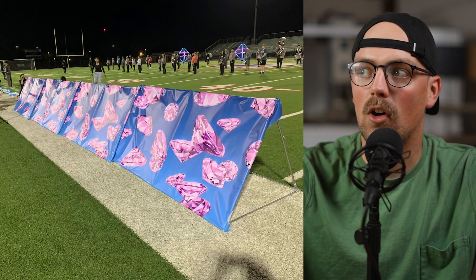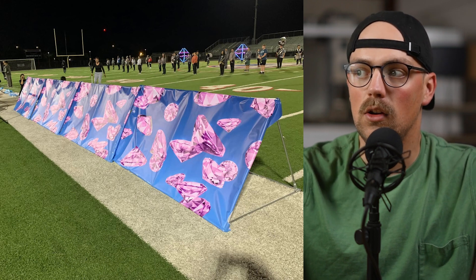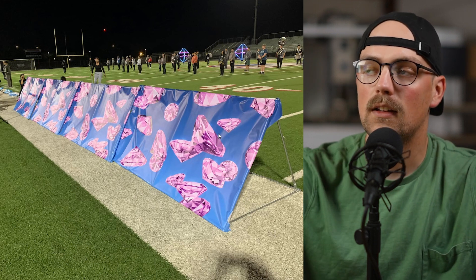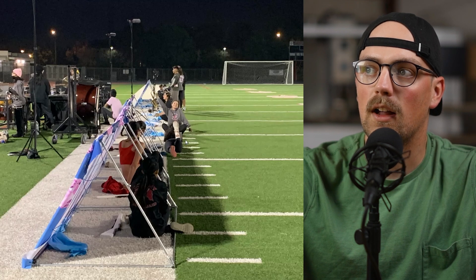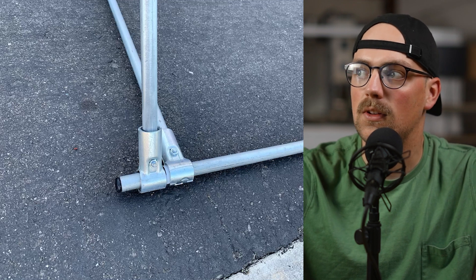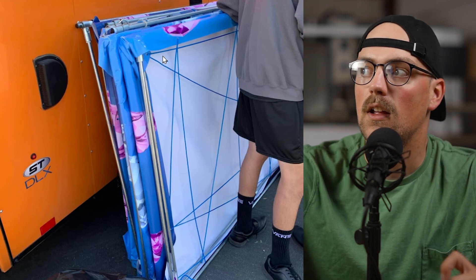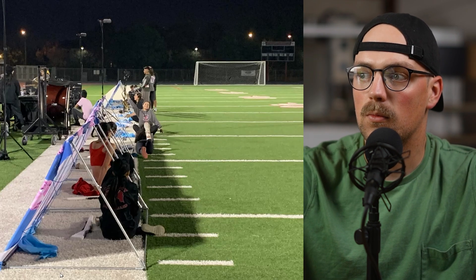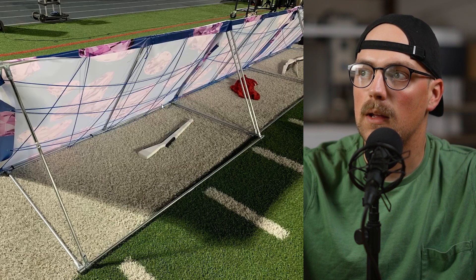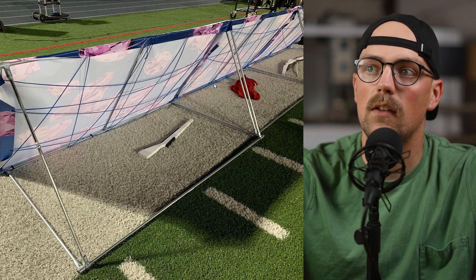Next up is a project from Paul. This one is really simple but very versatile no matter what your theme is or how big your show is, because this is a collapsible frame with vinyl attached to the front. You can customize the vinyl to anything you're working with and then attach it to your frames. Paul made these to be able to stow really easily. Some band members are kind of hiding behind these during the show and probably come out to do something cool. The frames fold up nicely to be stored in the trailer and hauled to away games or competitions. The frames use Maker Pipe T connectors and half-inch EMT conduit in a simple triangular frame, with a pipe at the front and top and T connectors at an angle to make the triangle slant for the canvas.